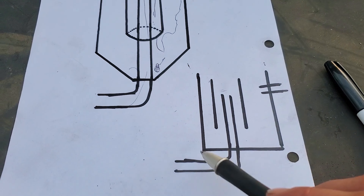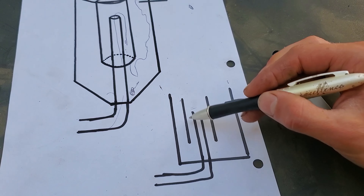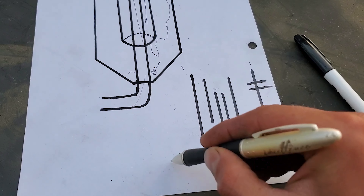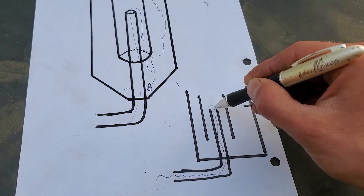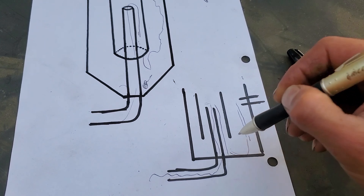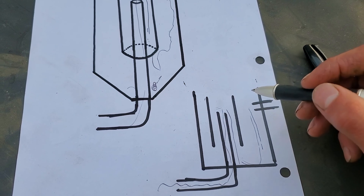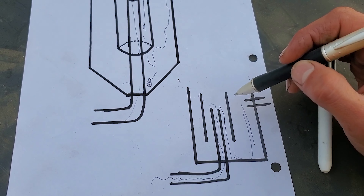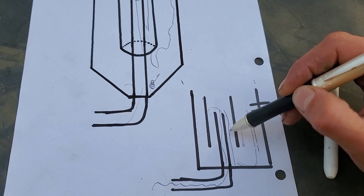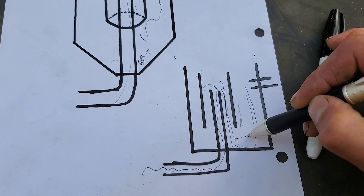Here's another drawing or example. You have your tank, your pipe in the center, your baffle, and another pipe out. You can have the water coming in through here — it goes up, then the water has to settle down, and then go back up and out through there. Either way works. You can have the water enter the tank in any direction; it's just a matter of having something like this baffle which forces the water and the solids to go down before going back up.